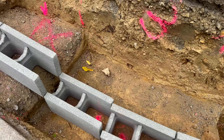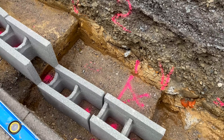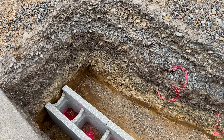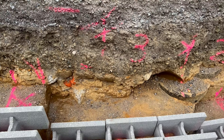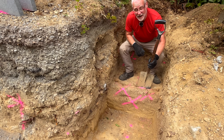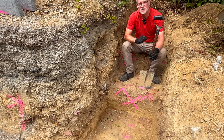I've marked every center of every block. I won't be putting that many vertical supports in — there'll be one every 400 millimeters, or 16 inches — so I'll be missing every other hole. But having every hole marked gives me choices as to where I start and finish my support work. Now that the layout is complete, a little bit of trimming on these three steps and then we're ready to get some steel reinforcement bent and put into place.